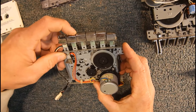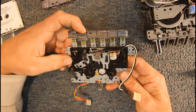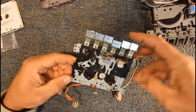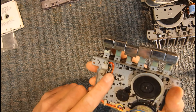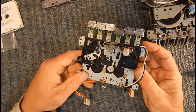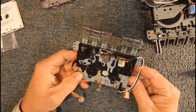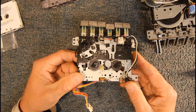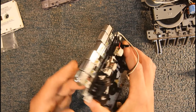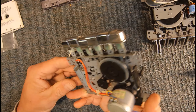Sometimes you'll get faults with the slide bars — there are a whole bunch of sliding bits that go sideways as well as levers that go up and down, all hidden under the plastic part and the heads. They can sometimes cause trouble if someone's bent something, like the little lever that presses on the switch being bent and not pressing it. Generally these are pretty reliable, but never go and put lubrication of any sort all over a tape deck — it's the best way to ruin them.